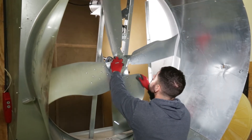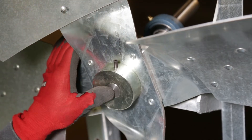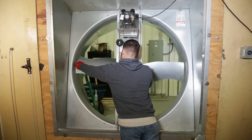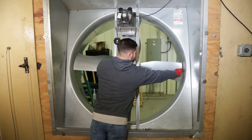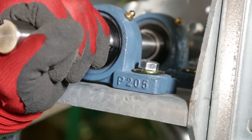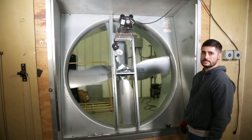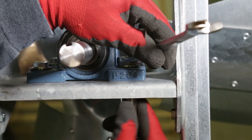After you are assured the propeller fits, use a hammer to drive the locking pin into place on the propeller hub. At this point you'll need to adjust the propeller to center it evenly inside the housing. Use your fingers to gauge the amount of clearance on each side of the propeller between the blade and the housing. Then make any adjustments by sliding the bearings in unison in either direction on the weldment. Once the propeller is centered, tighten down the bolts holding the bearings in place.